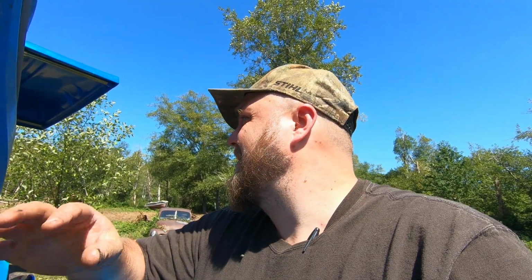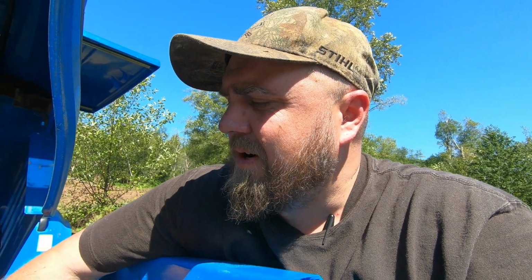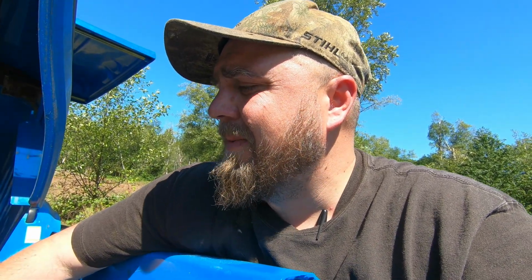It has been so dusty these last 2 years, and we try to clean the air cleaner out periodically, but I'm gonna pop this thing out, blow it out, leave it on the shelf for a backup, then put a new fresh one in, because it has been such a dusty year. We're just getting to the end of the year, so I'd rather go into winter with fresh oil, fresh air filter. That way if anything does go wrong, I'm not out in the back.